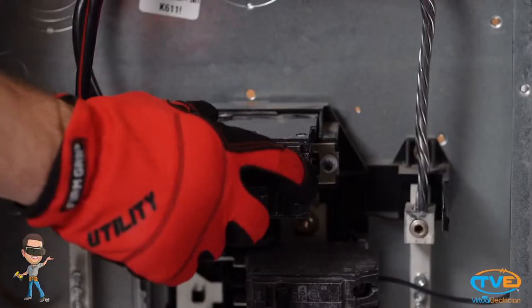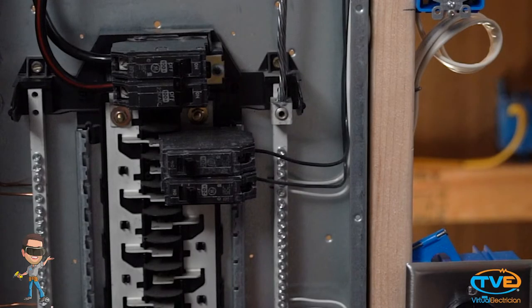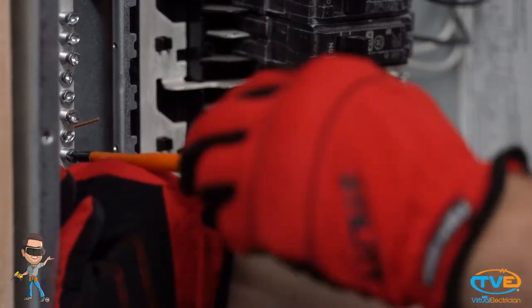You're either going to have two-wire or three-wire for your two-pole breaker. If it's three-wire, it's pretty easy — just follow my same instructions on installing a single-pole breaker. Turn the main off, don't touch the main lugs coming in. Use 90-degree turns, connect the ground first, then the neutral, and now your hots.